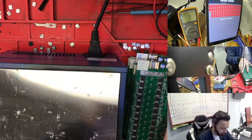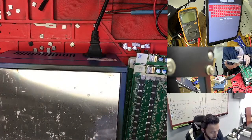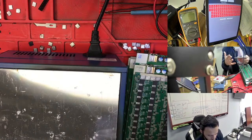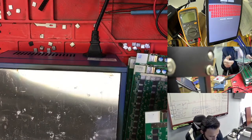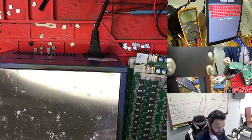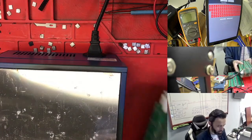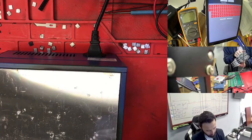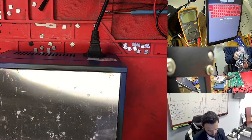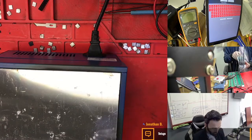For example, I tested this hashboard and it is blocking at chip number two. So quickly I change chip number two, and after that it blocks somewhere else. What I see on StrongU is that all of the boards have the same number, but some have a zero here. This is 4955, something like this.